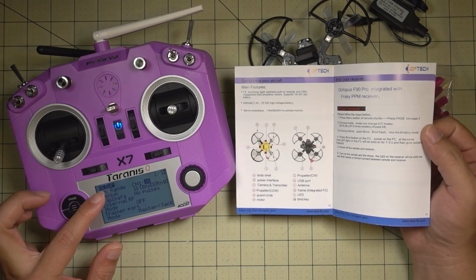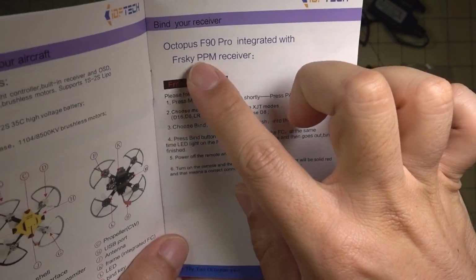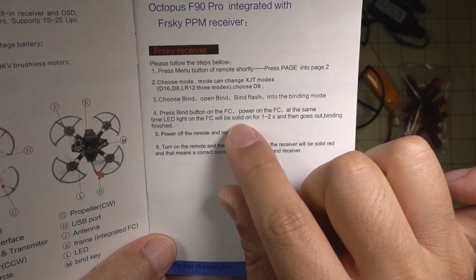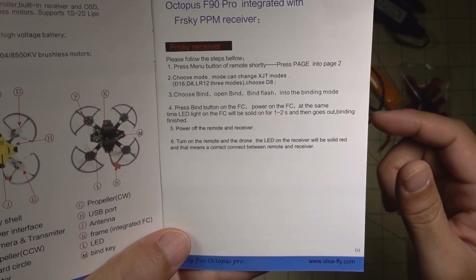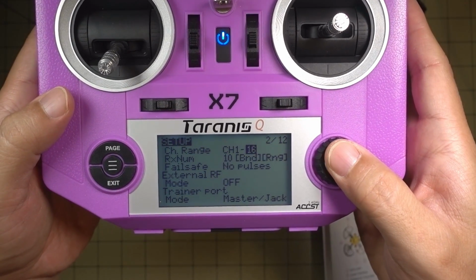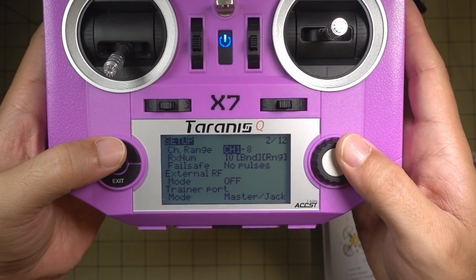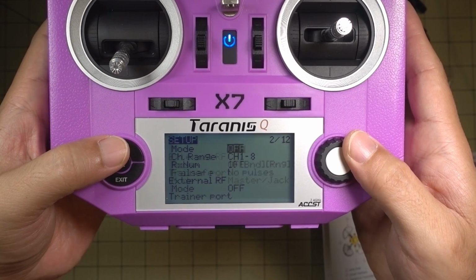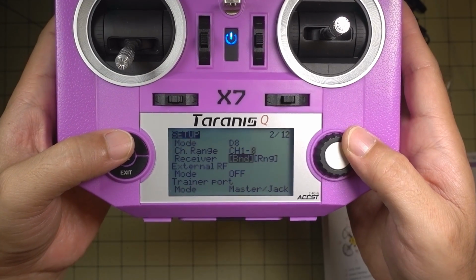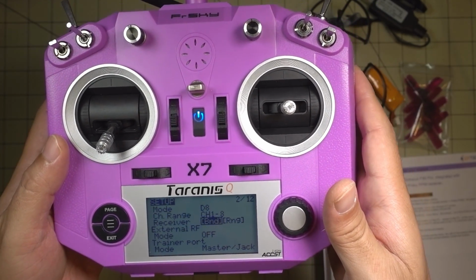Okay, so I've created a new model in my Taranis here, and then the instructions here for the integrated receiver, which is a PPM receiver, do say we need to choose D8 mode, and then you can just follow these instructions to do the binding, but I'll show you real quickly how to do that. It's pretty easy. So I'm going to change my channel range from 1 to 16 to 1 to 8, and then we're going to go up here to the mode and change that to D8 mode, and then we're going to go down to the receiver and hit bind, and then the Taranis should start beeping. There we go.